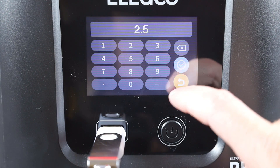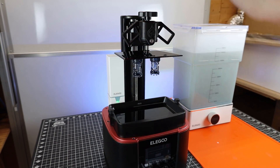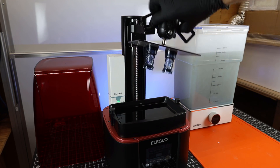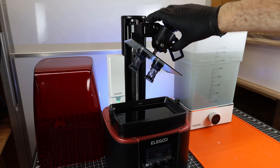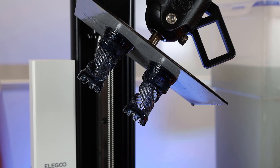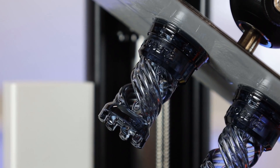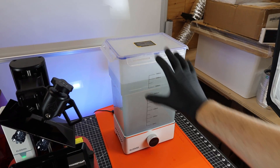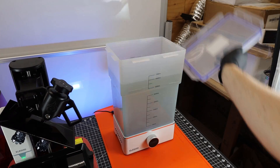After about two hours, they're all done. Everything is completely covered in uncured resin, and that's where this hanger comes in handy — it basically just allows you to drip dry at an angle, getting more resin off your parts and back into the vat. A closer look at the prints shows that they came out successfully, but they're still completely covered in resin, so we need to wash them off. To do this, I'm going to be using some 99% alcohol.